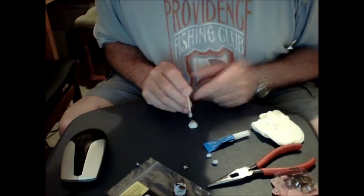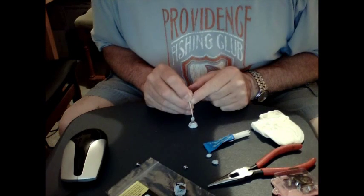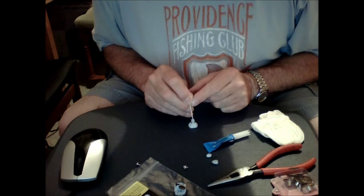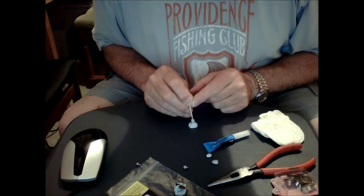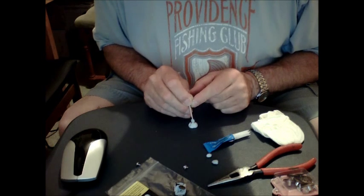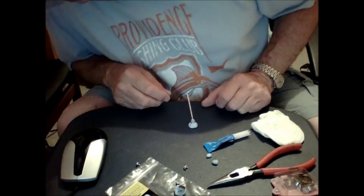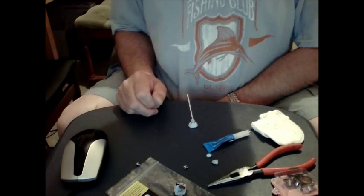I can see all around it and I can check my alignment. I'm going to bring this down dead center. Just a moment to adjust it and hold it there. Hopefully I've got that centered on the pin. Give it about ten seconds. Having a good look at that all around — that's pretty well centered, and certainly it's centered enough for our purposes. It's about half a millimeter, if that, all around the magnet.